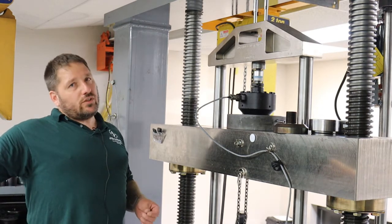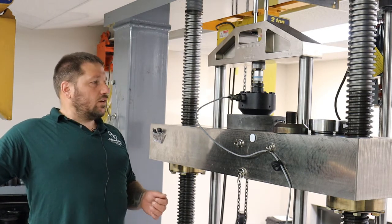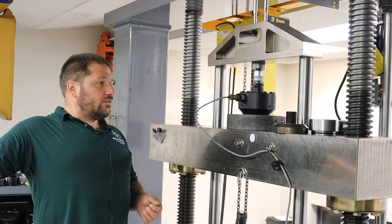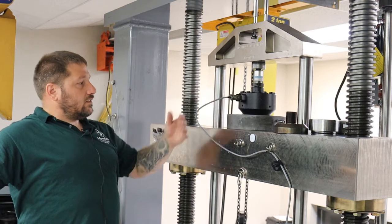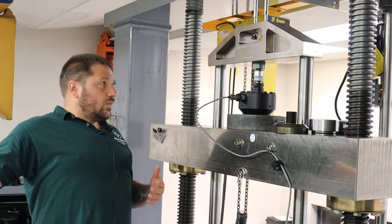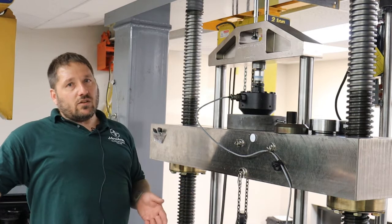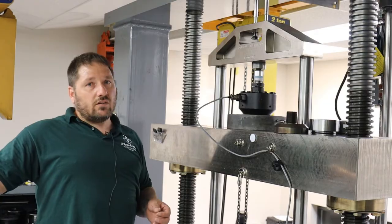It's really important, especially when you're doing something like E74 where you're doing a cal in rotation. So now I can guarantee that this load cell is in perfect alignment with the machine and I should get good numbers. If I have other issues, I can at least rely on my alignment and look into other issues to figure out what's wrong with the load cell.